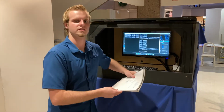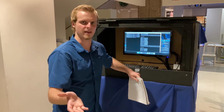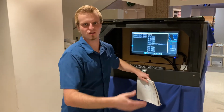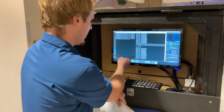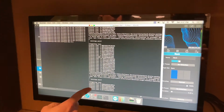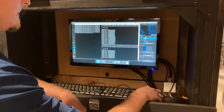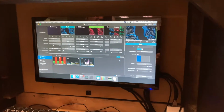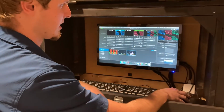How the algorithm works is it allows the user to wave their hand and trigger the next video in a sequence, and then after a certain amount of timeout, we play an interim video that loops until someone approaches the attraction again. What you see here is the timeout on the script, and as it approaches 20 seconds, which is what we have set arbitrarily, it will trigger the interim loop. I can go over to the video software, and if I want, I can manually override and trigger a video that will play. And this shows you how the screen is divided into the 3 sections right here.